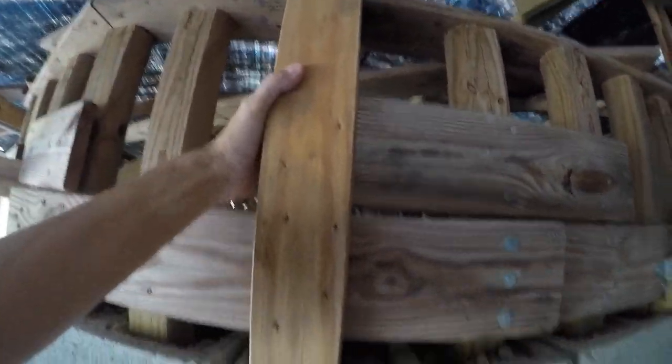So this rafter is supported as before. Screws, screws, screws. Cross member attached to the piling, to the rafter. This rafter is supported by this 2x4 attached to the timbers of the pond. There's another one, same thing, attached to the pond. Here is a timber outside, 8 foot, that runs and attached. It is attached to the pond, and also holds up the rafter. That's the second one, same thing.